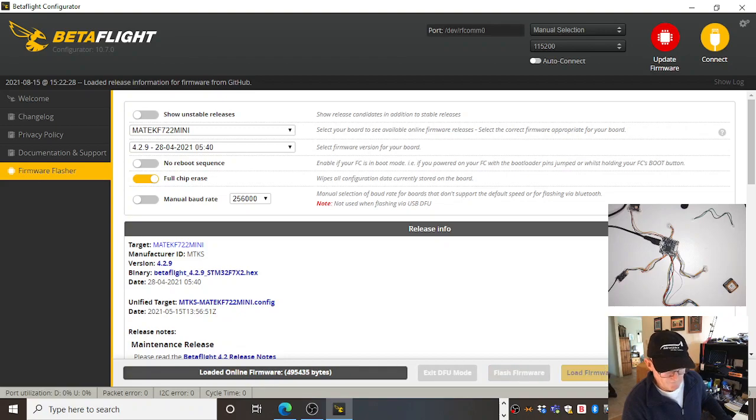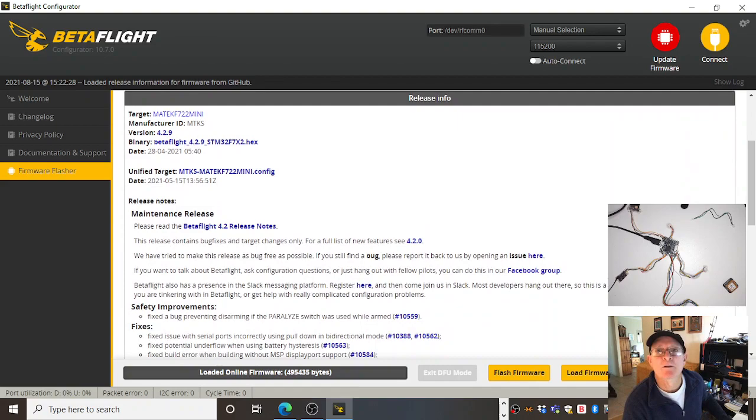And if I didn't want to load it, if I wanted to load it locally, what would I do? Go to the right thing, get the right target, download the right target to your hard drive, which would be what kind of file? Hexadecimal file, and then you'll pick it up from there.